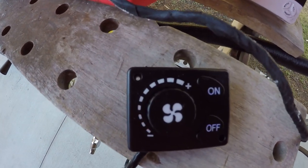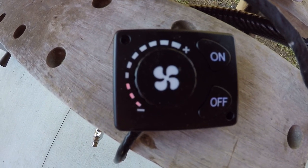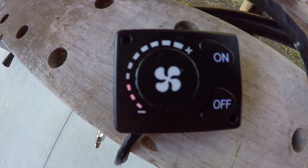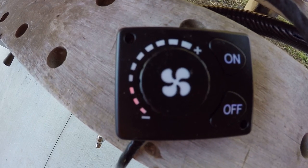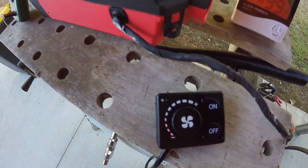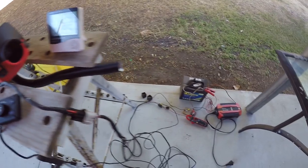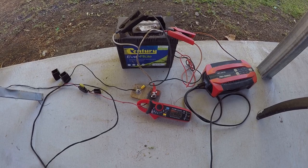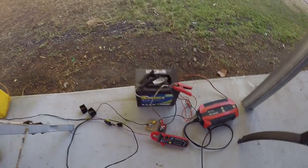It failed to start. You can see three LEDs flashing — these little manual controllers give you an error code. Three LEDs flashing is the same as an E03 error. A normal E03 error means the glow plug is not lighting. I suspect because I haven't used this battery for a while it couldn't provide the 10 amps needed to start the glow plug.